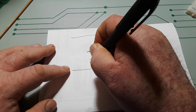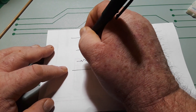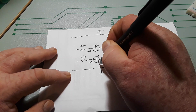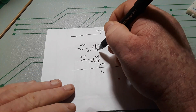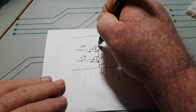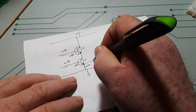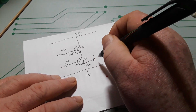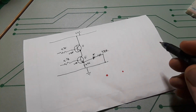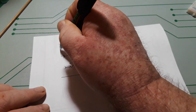This again is a C1815. These are 4.7K — anywhere between 1K and 10K is fine. Then this goes through another 4.7K to ground. We connect the emitter — we'll call this one number one and this one number two. The emitter of number one goes to the collector of number two. This collector goes to the VCC rail, and right here we're going to come off to our LED through another resistor, which in this case is 470 ohms, and that goes to ground.